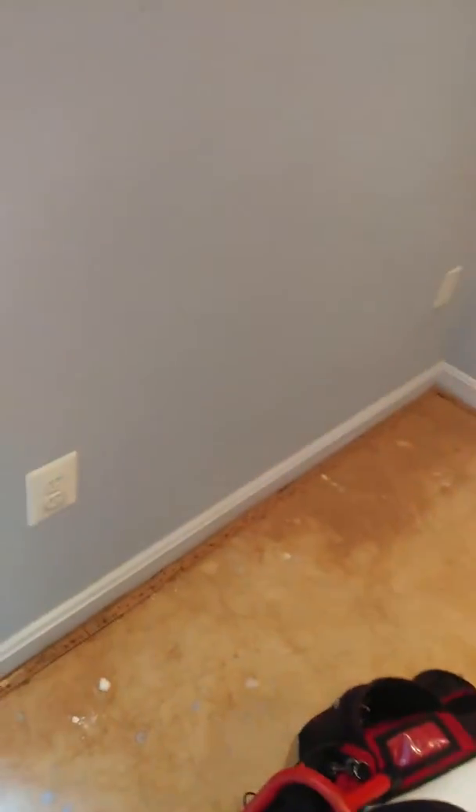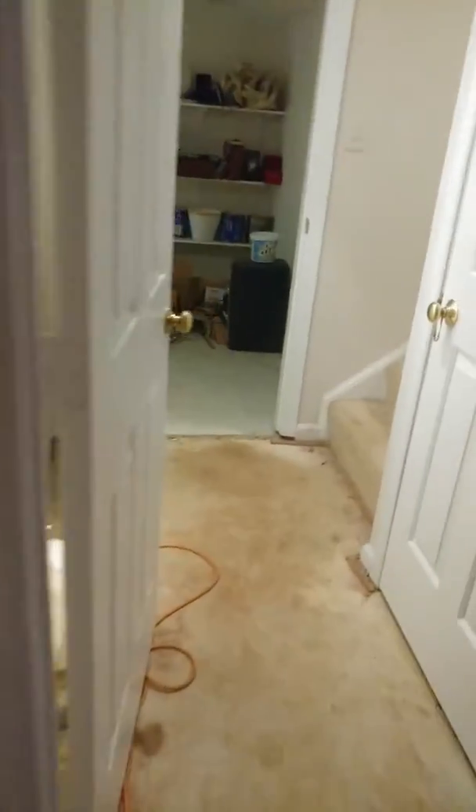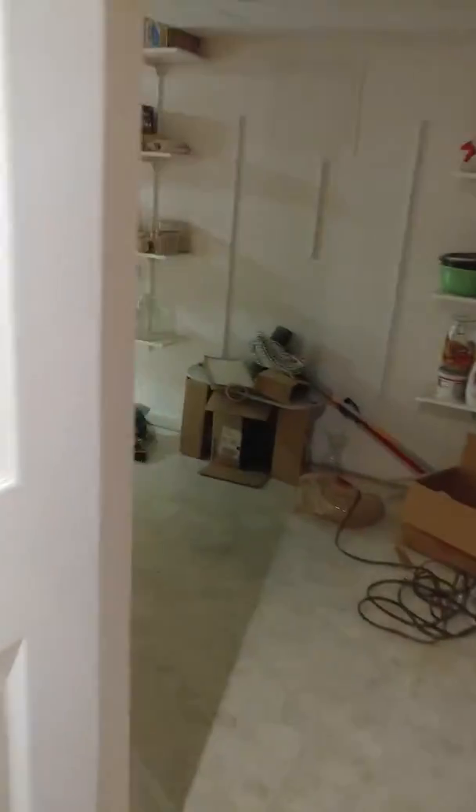We'll go 45 and 45. There is drain tile in here because I've videoed it through the sump pump, which I'm about to show you. It'll go this way toward the HVAC system — about 22 feet of jackhammering. There's also a bathroom over there; we want to try not to cut through that tile since everything else is unfinished.